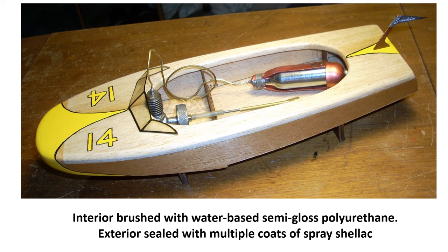This is the completed Squirt boat assembly with the Herkimer motor. Of note, towards the center of the photograph is a loop of copper tubing which connects the cartridge assembly to the top of the motor. This tubing provides slack which allows the manipulation of the cartridge assembly, as well as a loop to warm and expand the CO2 gas before it enters the motor.